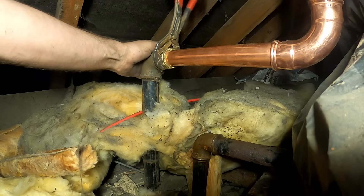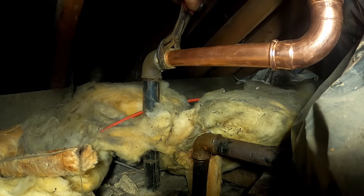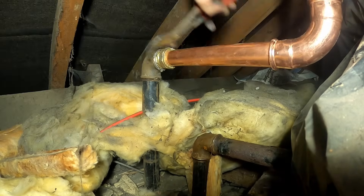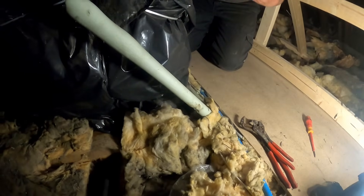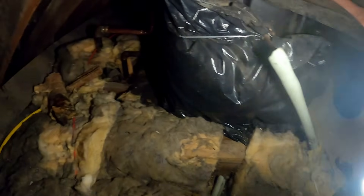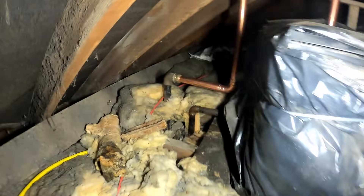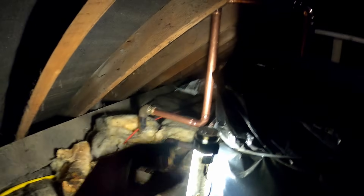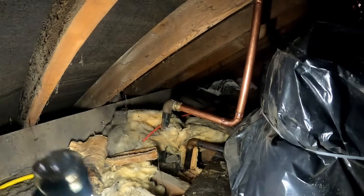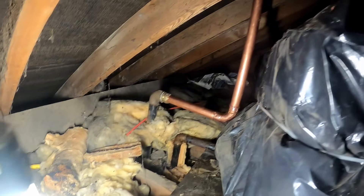I think that'll be dry, Pat. It's only a vent, innit? Is the boiler isolated? Yeah, that's fine. I can't believe they've run that blue poly in there like that. So that vent's all back in and connected up. The boiler was isolated, we're just refilling the header tank and we'll check the radiators. We'll make sure it's not pumping over. But yeah, apart from that, that's job done.